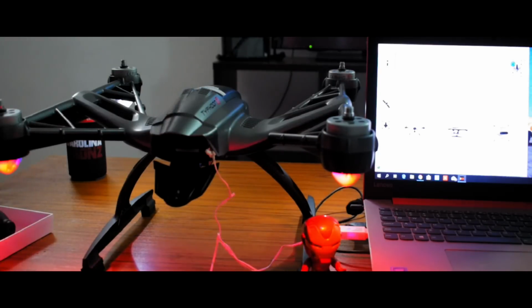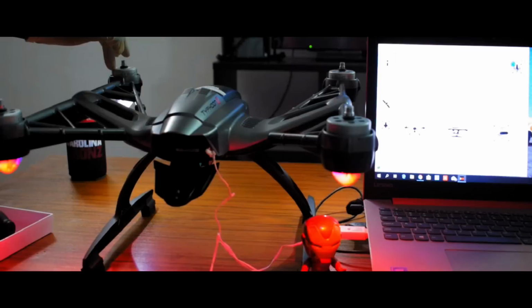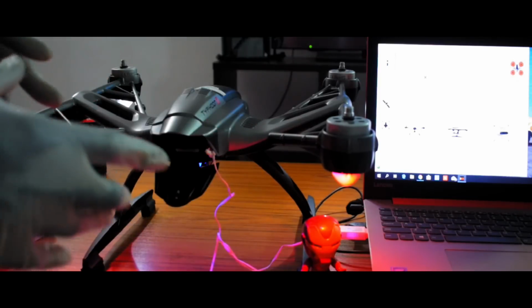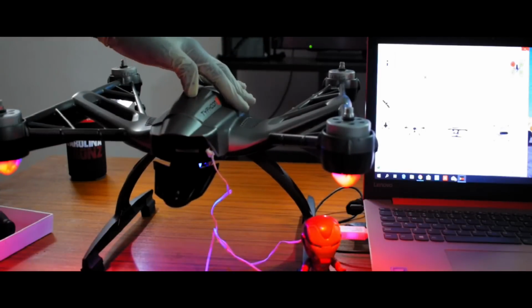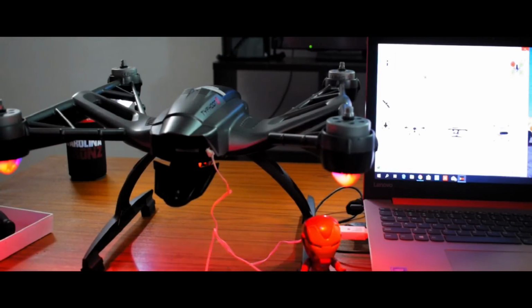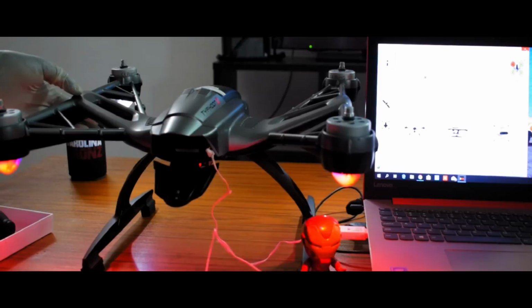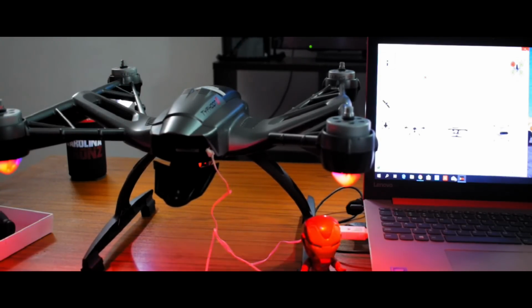As you can see, it starts by telling you to rotate in direction. So you take the blinking motors, you hear a beep. So it says now ESC 1, 2, 3, and 4 failed. Reason why we have a failed ESC, so it won't give you the proper calibration until the ESC gets fixed. That was a test. That is how you test all the motors and make sure that everything is working correctly. Now, as the software says, the front left ESC is the ESC that we have to change. So we're going to get right to that right now, and stay tuned, guys.